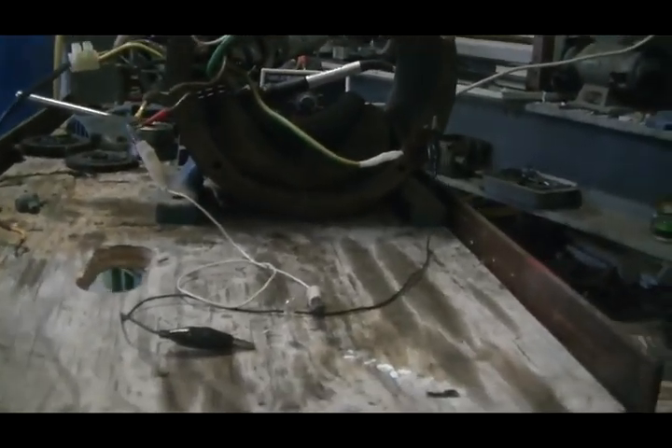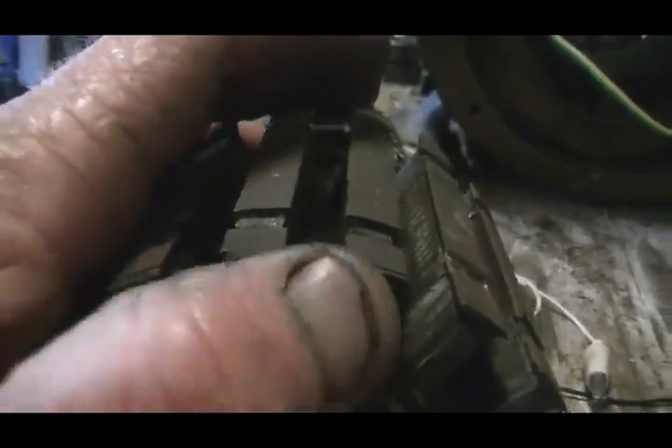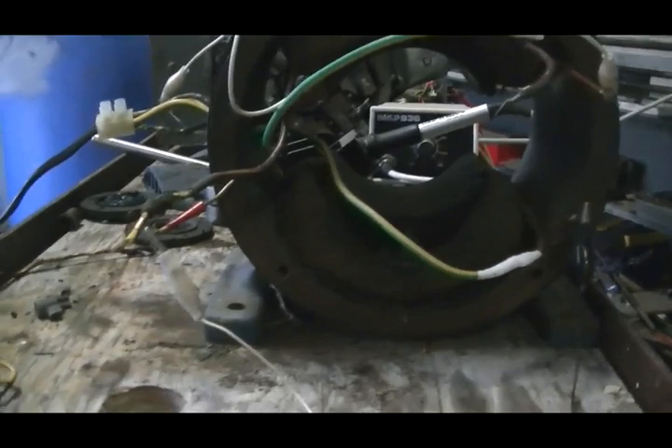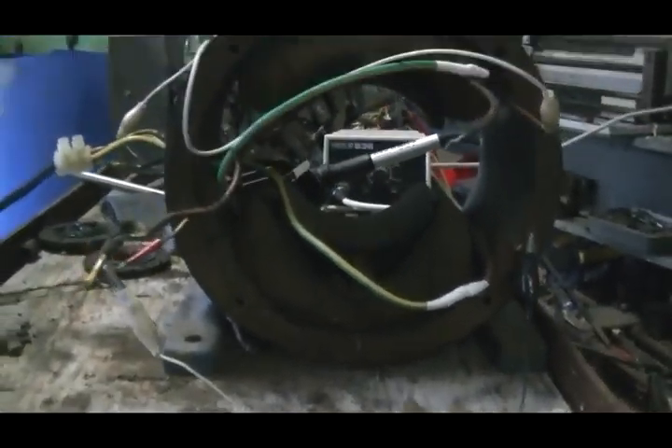So that is where we are up to at the moment. My next job is to cut one strip of the laminates out on our rotor, put the magnets in there, and glue them in with some very strong epoxy — and hope that they don't fly out. I'll make another video as soon as I get the magnets in place and the system wired up. Cheers from the Tin Man.